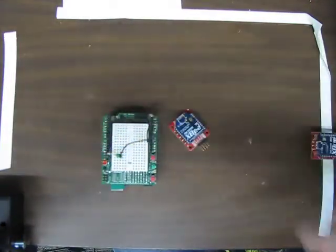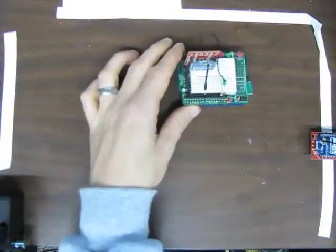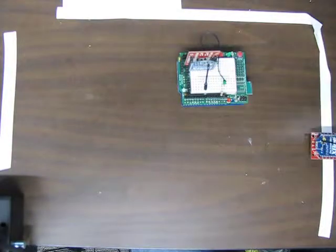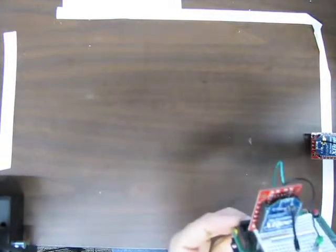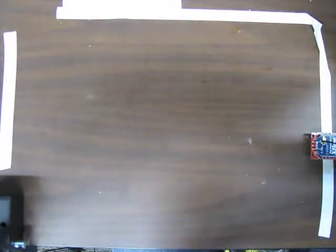And then let's unplug the power here while we construct the circuit. So I'll plug in the Xbee, and now we have 4 different connections to make. There's power and ground, so we'll hook up 5V power, which is the second pin here, to the 5V supply, and we'll hook up ground, which is the outermost, to an available ground pin.